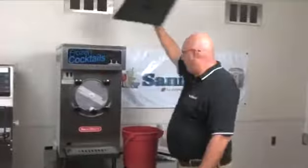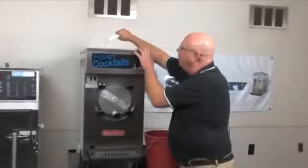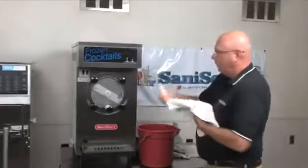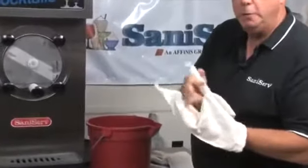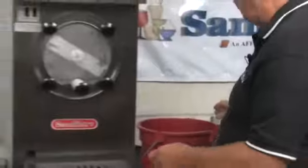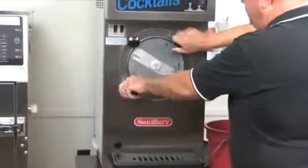I need to get the lid off, get the carb tube out, or restrictor tube. I'm going to get the O-ring off. I'm going to put extra room down here on a dry cloth. I'm going to pinch, I'm going to push up. It makes the O-ring pucker and it slides right off. I'm going to have a little bit of water that spills out. There's not a lot I can do about that, so I'm just going to let it go.